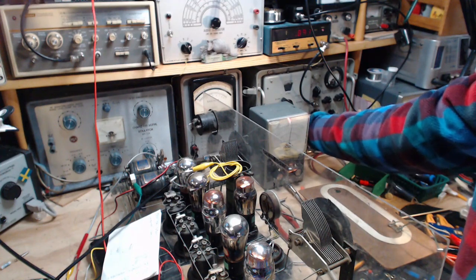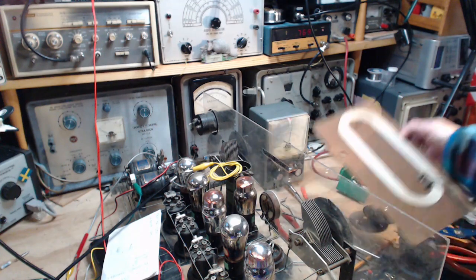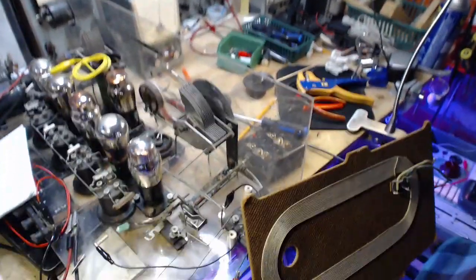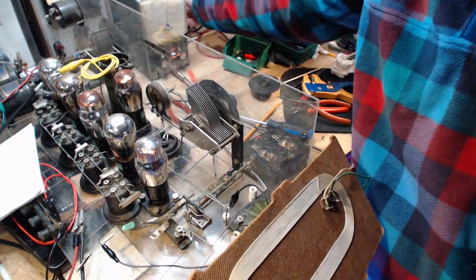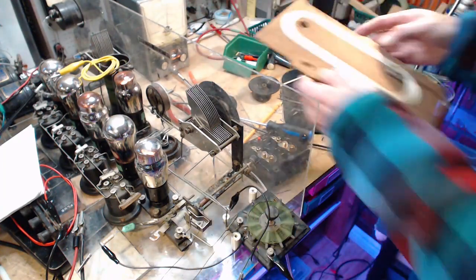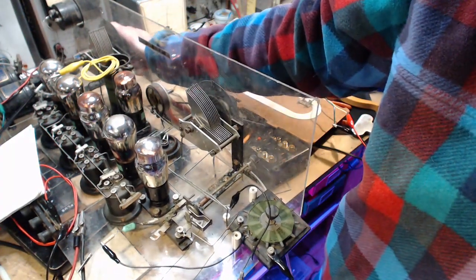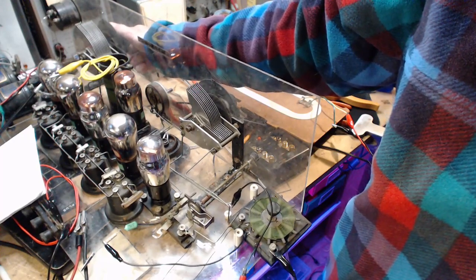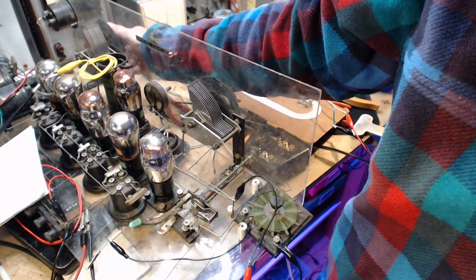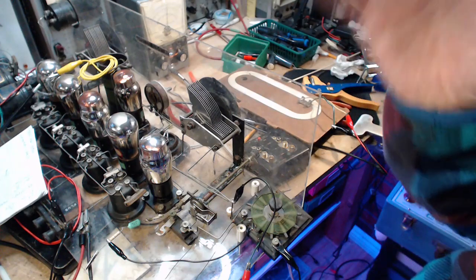That's a little disappointing. Closely couple these two coils here. Okay, let's do this. Look at the SDR, figure out what frequency we're on. So I'm gonna actually set this to video. Got very quiet, so let's go down where it's noisy. Set it to 800. Local oscillator 800, reception should be around 725.